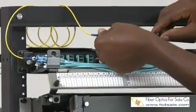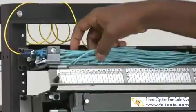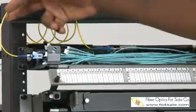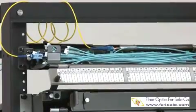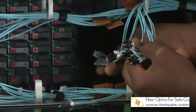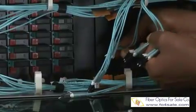I will plug in this connector to this end here and let it in just a little bit of the way. I have a bunch of jumpers here, and there is no problem with single mode going into multimode fiber — it works out. I will look on the other end and try to find the jumper I am looking for. By pointing these jumpers to this black surface here, I don't see a light off of those ones. I don't see a light there. I see a light on this one.